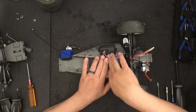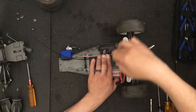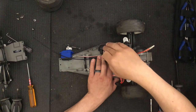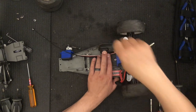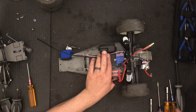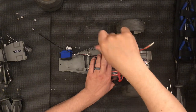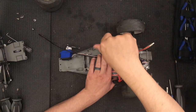Once you do this, just hold them down. Everything is good right in here. Go ahead and put some lubricant in there — some grease, even Vaseline will work. That's what actually seals it. If you do not do this and you run this in water or it falls in water, you will destroy the receiver. The receiver does not like moisture at all — found that out once.